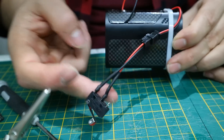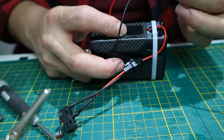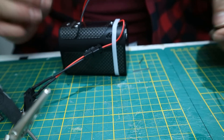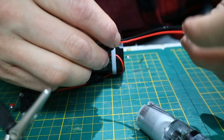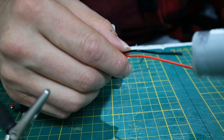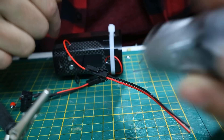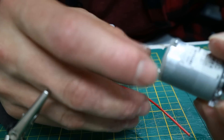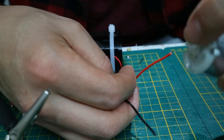We are not done soldering yet. We've made the button that activates the atomizer, but we still need to hook up a switch to the air pump. The other side of the quick connector goes directly to the battery. If I hooked the two wires directly to the air pump, it would turn on immediately as soon as the batteries are in. So we're going to solder the black wire directly to the air pump, and for the red one we'll hook up one of those micro switches, connecting the other side of the switch to the other terminal of the air pump.